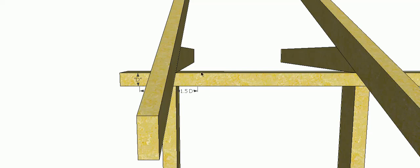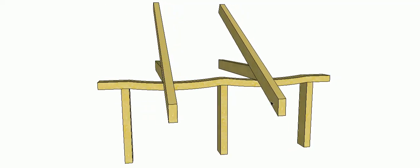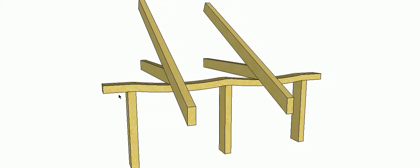However, if we weren't within that zone — if these trusses sat out in the middle of our top plate — then this is what they call random loading. Because we don't know exactly where that's going to land; it could be over to this side, could be over to this side, could be just about anywhere. But the end result is that we're going to get deflection, movement, or bowing in our top plate.